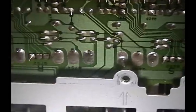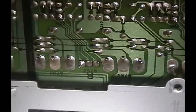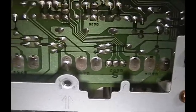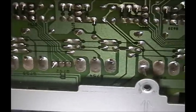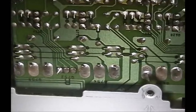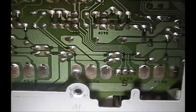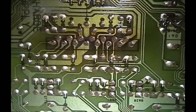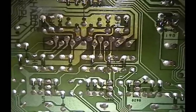What I did before was I just reheated all the solder — reflowed it. And that is not a fix. I don't care who you talk to, that is only a temporary fix because you have to clean out all the oxidation and all the crap that's now in the solder. So you have to desolder completely and re-solder it. A lot of people say you can just reflow the solder — yeah, that'll work temporarily, but it's not a permanent fix.